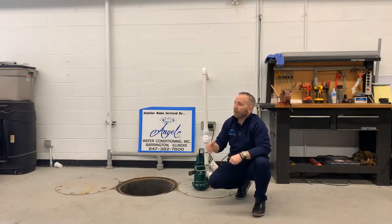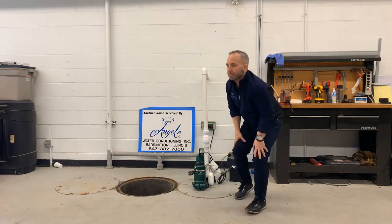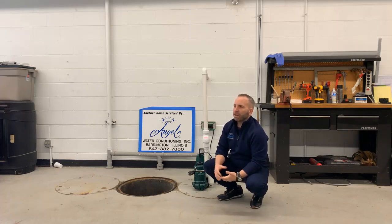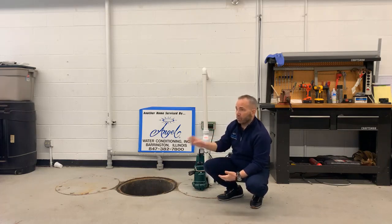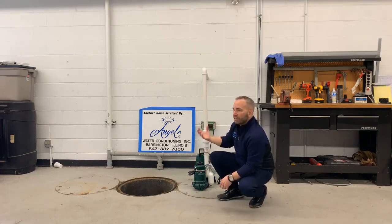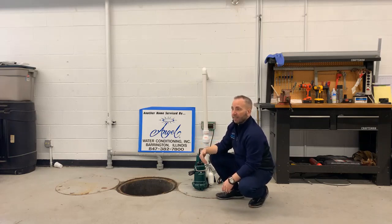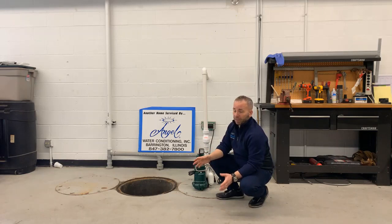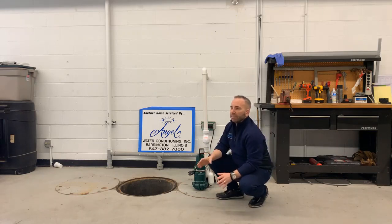If you need a helping hand we can give you a call. Our service personnel who come for water softener or maintenance checks can do a basic check on the sump pump, but calculating whether you have enough volume capacity is hard to do on-site. The best preventive maintenance is: one, make sure your downspouts are ported away from the house; two, when it rains heavily go down and listen to how often the pump is kicking on and off, then go outside to make sure it's discharging properly away from the house.